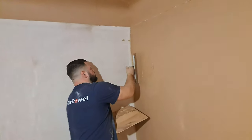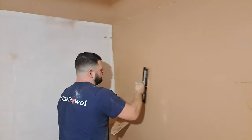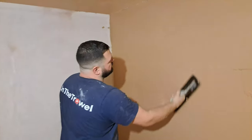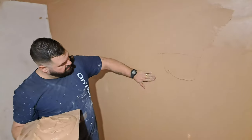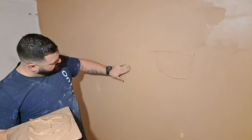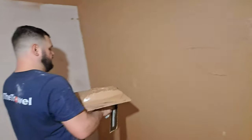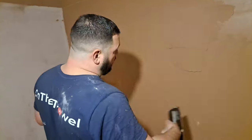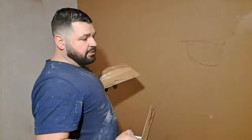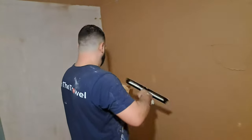So you're going to get this wall second coated now. Oh, for some reason, bits of this have gone in, look. See, I mean, that's still workable. Some bits go in faster than others. Don't panic, but you need to work efficiently. I haven't got loads of time for yapping, you know. I need to go over that because I'm going to have hassle smoothing it out when I'm troweling up if the second coat dries in that quick.